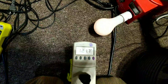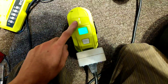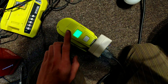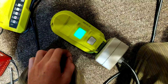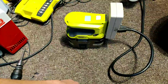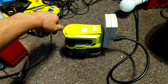And there it goes — exactly 200 watts, it gives up. It's not going to power any more than that, but as you can see it is still running. The fuse didn't blow — as we've seen, the fuse goes directly across the positive rail to the boost circuitry. So if this unit completely dies and won't turn on at all, check the fuse, because that's most likely what's wrong. That's basically the Ryobi 150 watt 18 volt inverter — thanks for watching guys, comment, rate, and subscribe. It helps me out a lot and I'll see you in the next video. Take care.